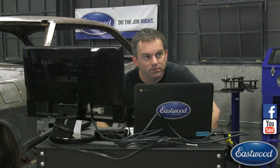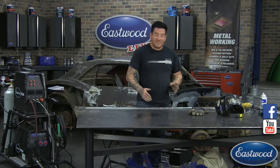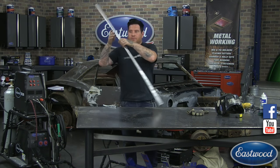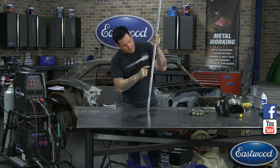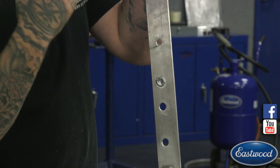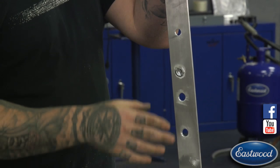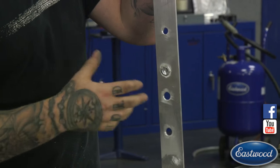So Bob asked what the technique would be if the metal was vertical instead of horizontal. It's basically the same. The way I'm doing it, even if it was vertical, if we were filling this hole here, I'm goosing the pedal, giving the pedal amperage when I want the filler rod in there. So it's not staying hot long enough for gravity to basically affect it, where sometimes when you're welding, say with a MIG welder or stick, it changes the technique because of going up and down.